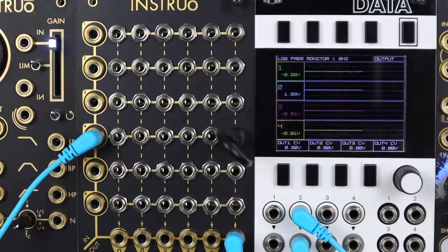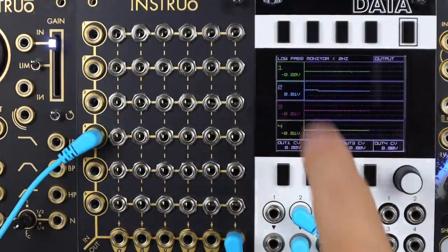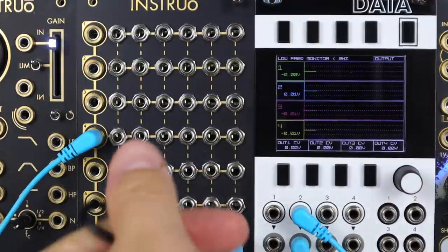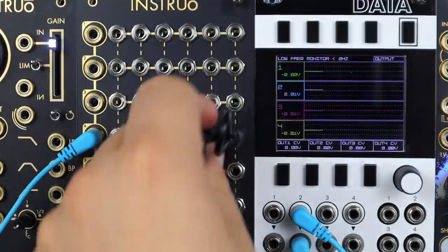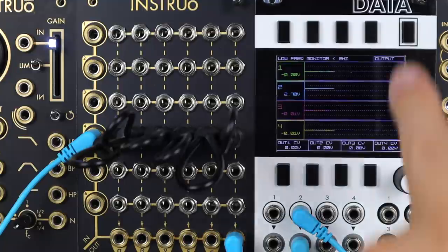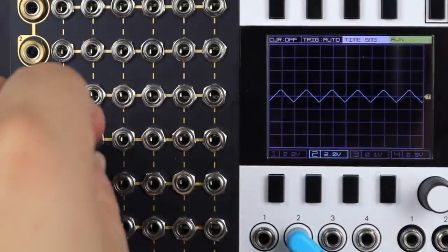Here I just wanted to quickly explain that we can actually amplify signals on Leon. Coming out of a single output into the voltage monitor, a single input reads 1.03 volts. But as I stack this up we get more than two times gain — a bit less than three times gain. Doing this with audio, here's a triangle wave going up in level.